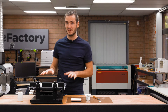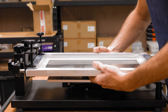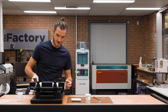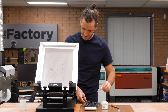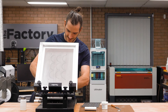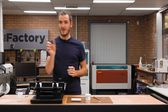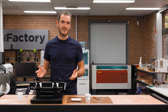The panel is only loosely positioned on the fixture plate. I leave it like this so that I can manually get the alignment pretty good before bothering with the fine adjustments — I found this to be a really fast way to get started. If I can manually bring those pads into the apertures and once that's close enough, I carefully open the machine, carefully remove the panel without bumping those supports, and then tighten them down while holding them in place. If they move a little in this step that's okay, you can just back them off and try again. The fine adjustments on this machine only have about 25 millimeters of travel, so the closer you get that coarse fit the easier the fine alignment step is.